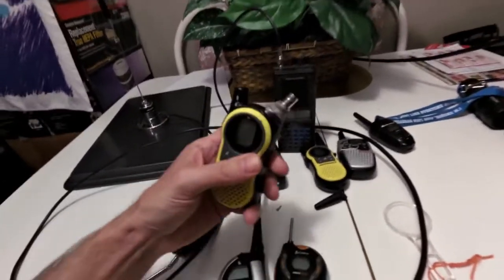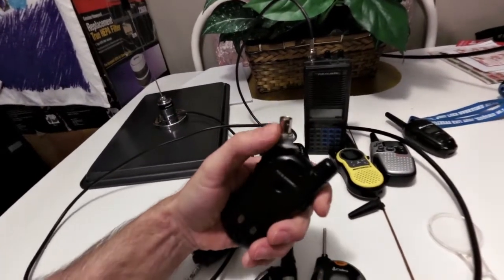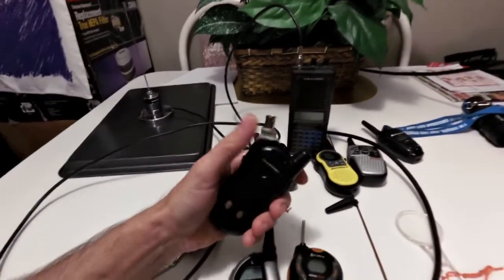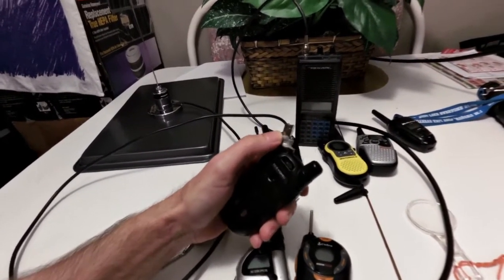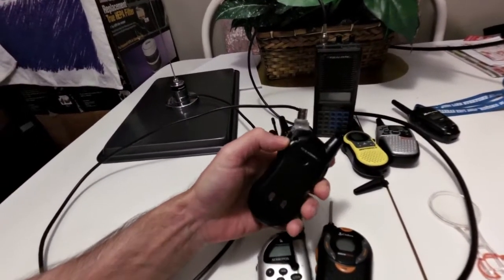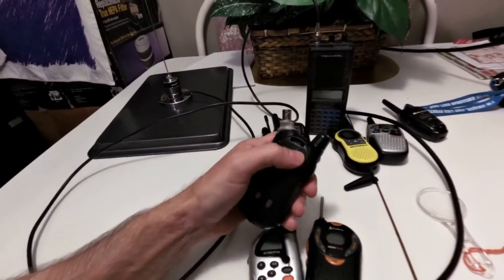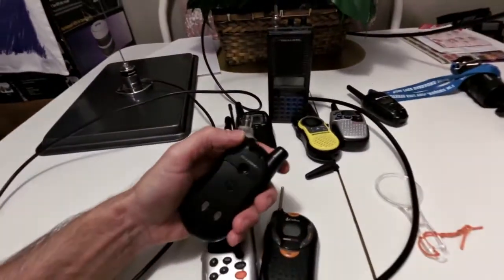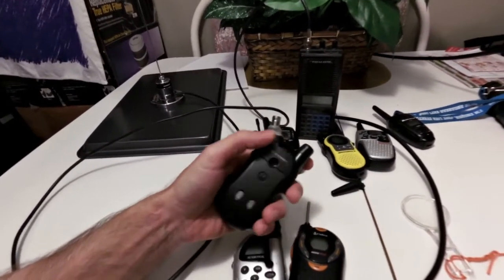Another thing people do is add external antennas like this, but that's technically illegal, so we're not going to be transmitting on this. We added an external antenna to it and use this one for receive only — in that case it's legal if you don't transmit with it. However, a lot of people make a mistake: if you don't attach a ground wire to the outside part, the whole length of your coax and antenna will act as one antenna and it won't tune properly. Or if you attach the ground wire from a point on the circuit board that is too far away, leaving like a three-inch piece in there, the whole length of cable will act as an antenna and change where your antenna is tuned, and it won't work. So you have to attach your ground as close as possible to the ground point on the circuit board — that's the only way it will work.